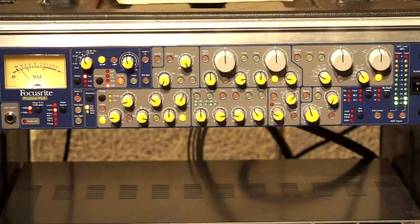So, this particular preamp has a little bit of a color to it. It is an analog preamp, and a lot of people really like the Focusrite preamps. It is not tube, however, so it's going to have a different sound quality than a tube preamp. So right now we're talking about preamps as if they are standalone devices, even though up to this point all of our preamps have been integrated with an audio interface or a mixing board. But yes, you can buy them standalone, and when you do, you're spending a lot more money, and usually you're getting a specific sound. The reason this is a little bit controversial is because you can also just record with a fairly clean sounding preamp and then get those colors with different plugins when you're mixing.